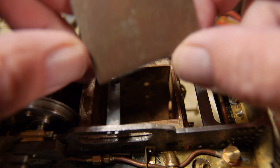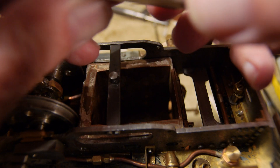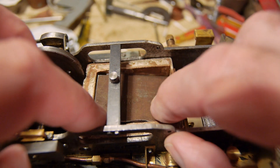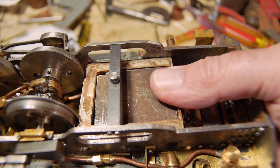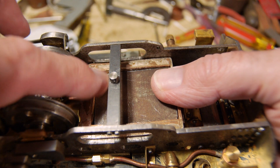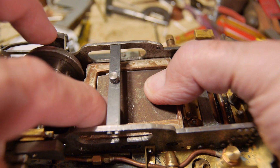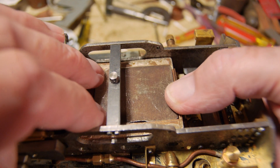Let's see how this fits now. I've cut the notches out where the lap joint takes place on the copper there, but I don't think I can pass it out through the door yet on the other side — it's still sticking and the stays are in the way. It's not quite sloppy enough yet. What I'll do first is drill the holes in it and then take another look.